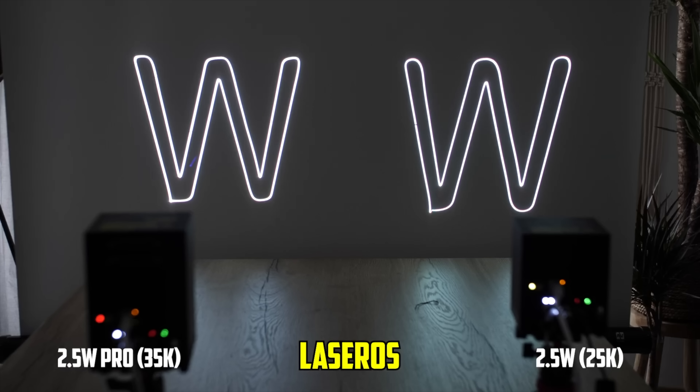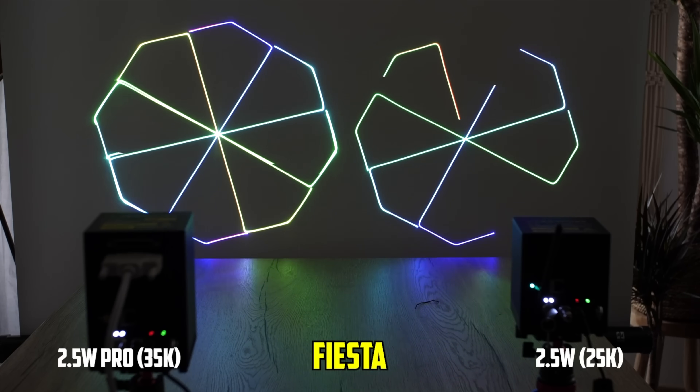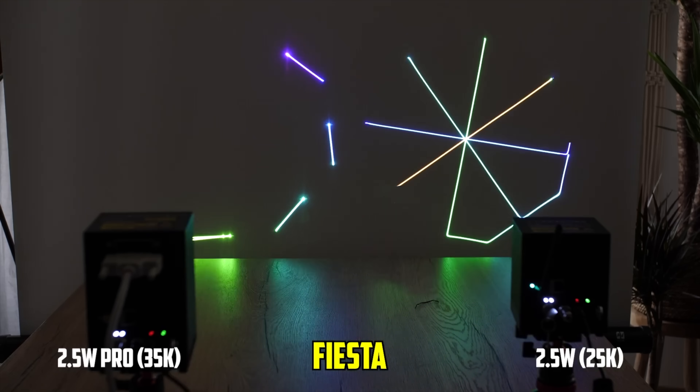To approximate what's going on, imagine you had two ping pong paddles with mirrored surfaces. You'd place one this way and then 90 degrees to the first, and with a little practice, by rotating your wrists, you can send the beam in pretty much any direction you wished. Ping pong paddles are quite big and wrists are quite slow, however, so the mirrors in a galvo system are typically very small and lightweight, allowing them to move very quickly and with high precision. The beam emitted by the LaserCube Pro is 4mm in diameter, with a divergence of 1 millirad, or one thousandth of a radian. The galvos in the LaserCube can draw at a rate of 35,000 unique points per second — the higher the number, the sharper the corners appear in the final drawing. The faster the galvos can draw the image, the higher the frame rate and the less flicker you will perceive.